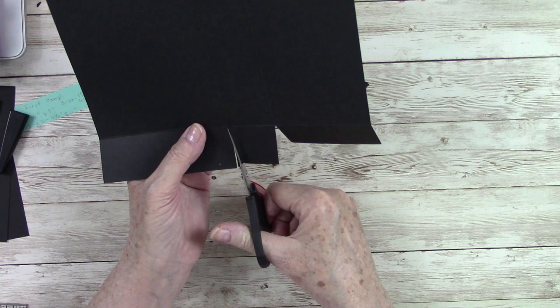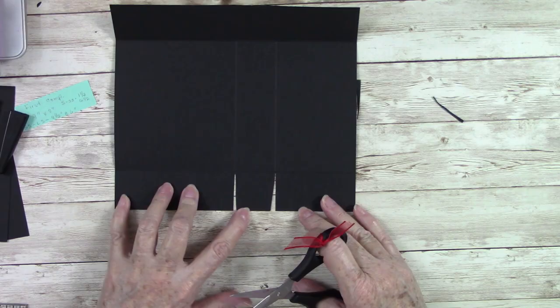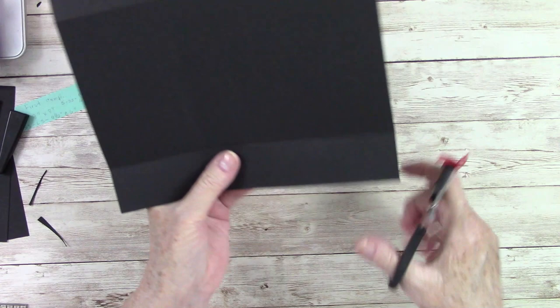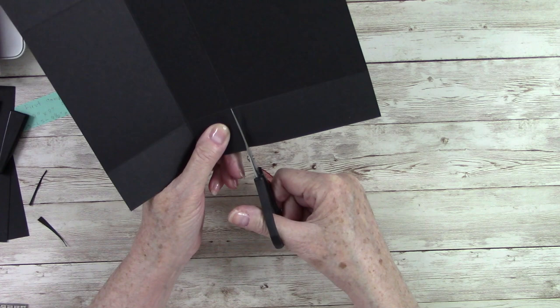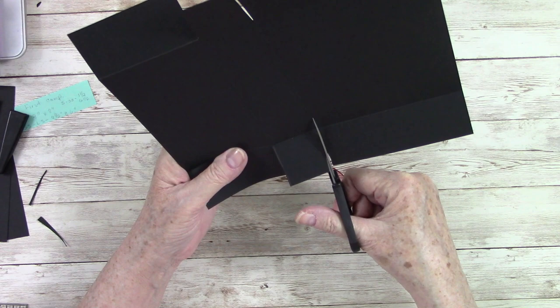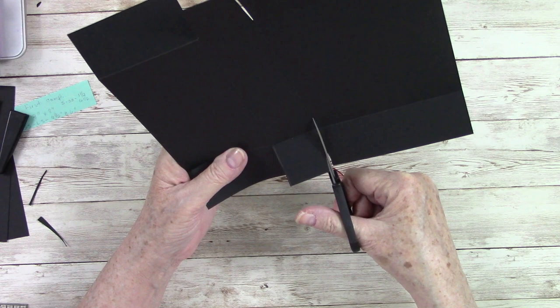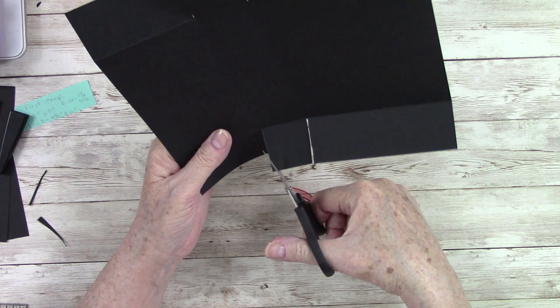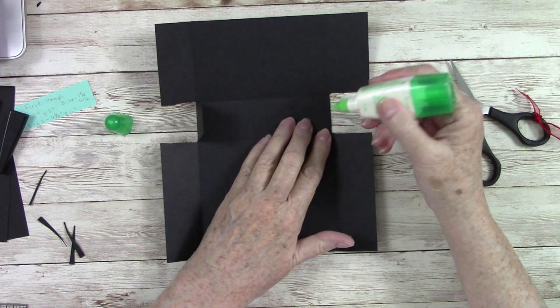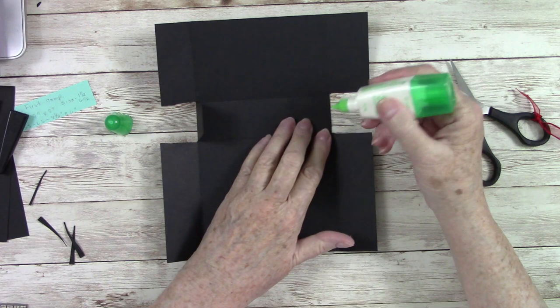Make the pie cut on both sides — all that's doing is taking out some of that bulk so when you lay it down you'll see your wedges. Turn it over and work on the other side the same way: cut to the right of the score line on the right side and to the left of the score line on the left side. Then angle those out and do the same on the other side.